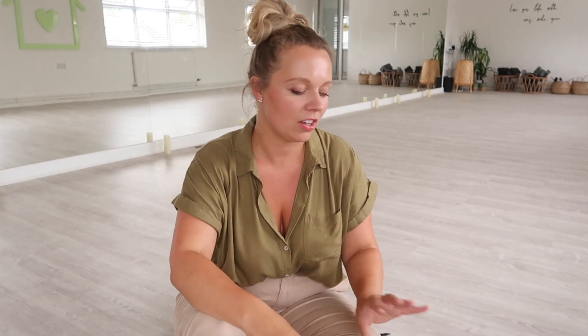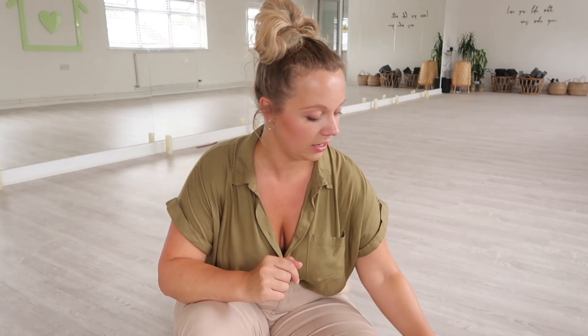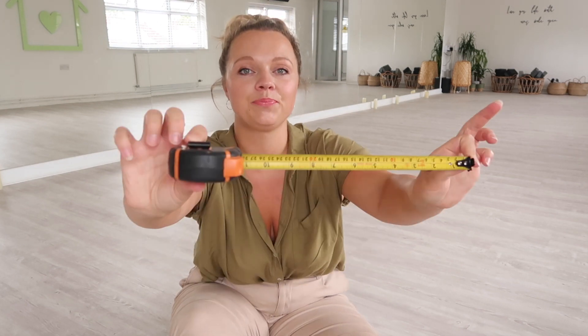I'm going to pretend I'm doing a site survey, so everything is very much real-life advice. I have some things with me that I usually take to site visits — you may have seen my previous video on that, I'll link it below. So first things first: the laser measure. This little device gives you the dimensions of the overall space. It's super handy — you have to have it. Use it for cross dimensions and ceiling heights.